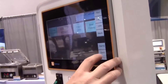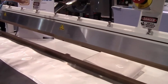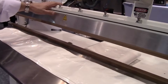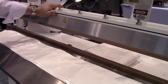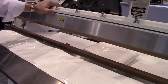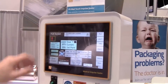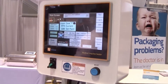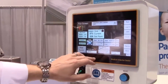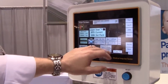This allows for the most versatility with medical sealing. We're running water cooling with a chiller to allow for faster cycle rates and consistent temperatures. We can cool for a specific period of time or cool to a specified temperature for further consistency. I can turn my chiller off and on and set the temperature for the water circulating through the jaws for water cooling.